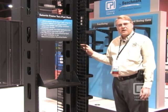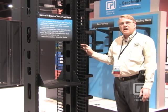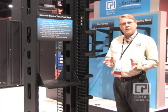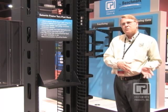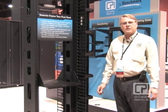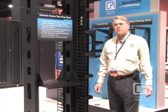It's rated for 1,000 pounds against the NEBS GR63 rating for Zone 4. Zone 4 refers to the division of the United States by susceptibility or probability of earthquakes occurring — Zone 4 tends to be on the west coast, but even in the middle of the country and on the east coast there's a probability of earthquakes occurring in the next 50 years. We've tested it to the highest standard, which is NEBS GR63 Zone 4.